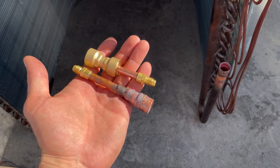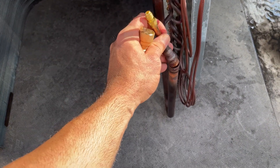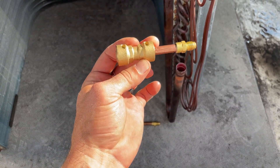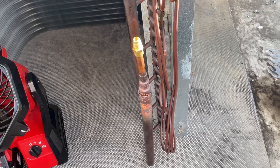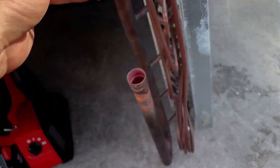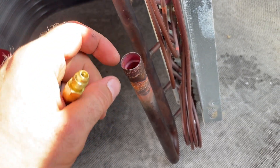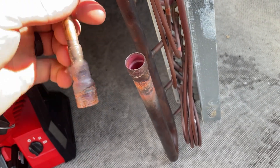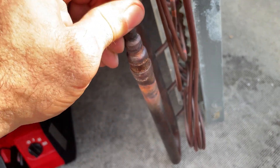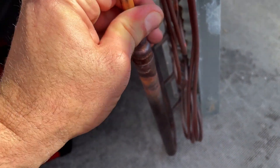Got the coil out and this is how I pressure test these — this adapter here, and then this little SharkBite fitting. I just want to point out that the reason I have this particular adapter setup is because the factory braze joint is right here. They actually swaged this to fit copper over top of it, but this will fit inside, so the braze that I'm adding is not going to interfere with getting this coil reinstalled.